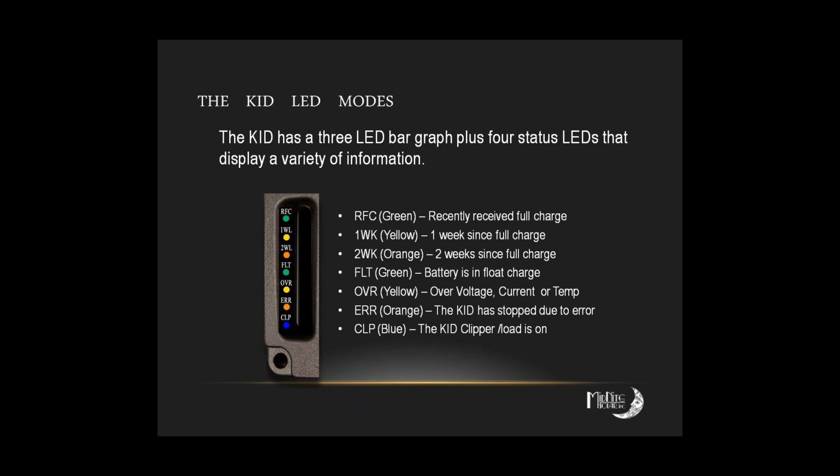What kind of enclosure are you usually installing these in? Is it a room? Is it a very small box? What do you have? So usually a small box, either a Hoffman enclosure or a metal tool tough box. Okay. Any means of ventilation there? Any vents of any type? We usually put in some 3-inch passive vents. Okay. All right. So there's at least some flow through there. That's good. Yep. All right.